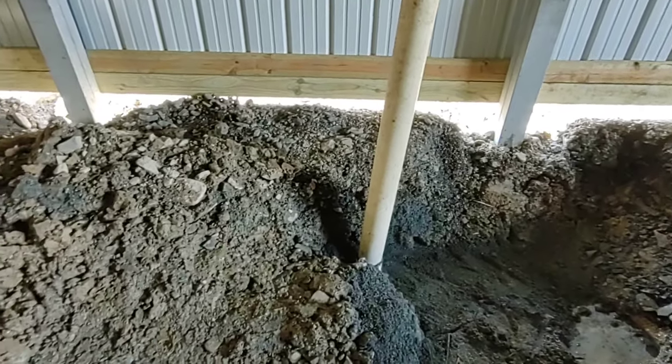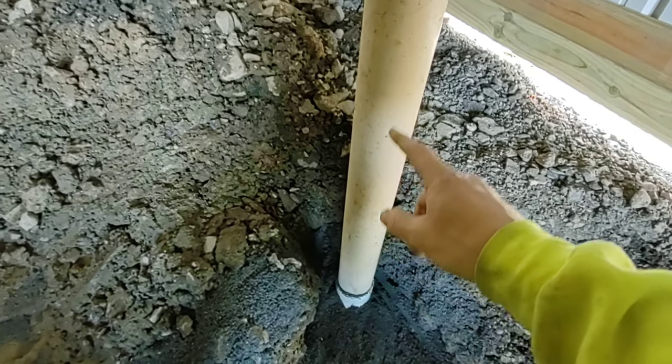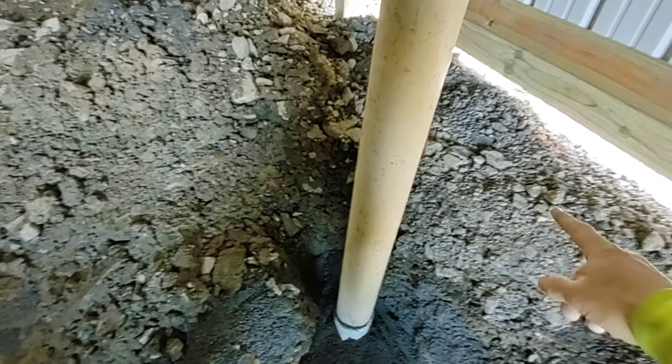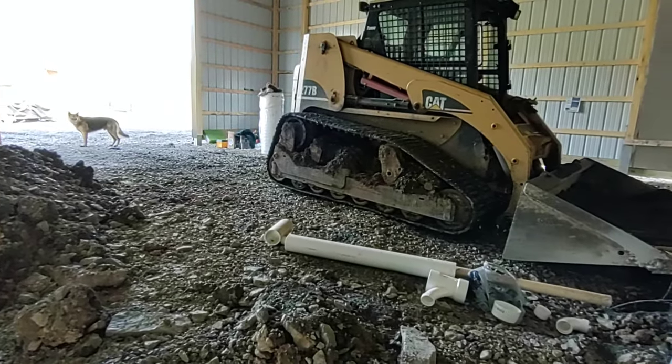Just wanted to get a short video to show you what's up here now. It'll make a little more sense once the concrete's poured, but for now that pipe's leaning a little towards the wall, but it won't matter — it's getting cut off flush with the floor. What we're going to do is set a four to two inch wye pipe in here and run a two inch drain over to go up this wall for a sink. As far as the pipe work goes, we're pretty much done. The rest is just backfilling and grading everything off.